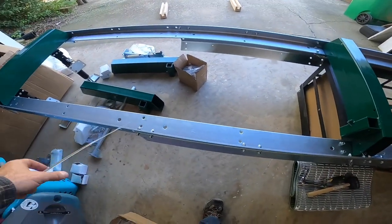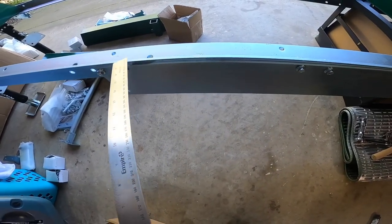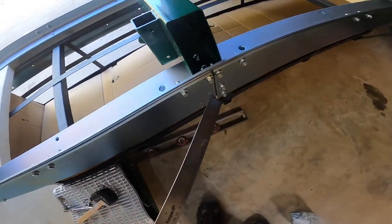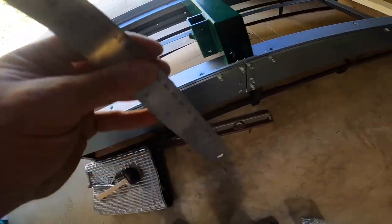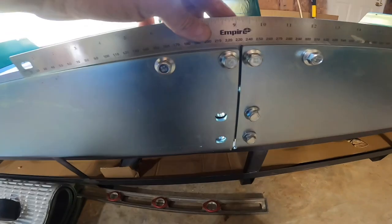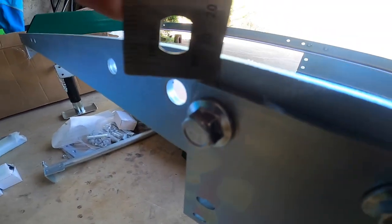All these side bolts are totally loose right now. What I'm going to do is make sure this reveal from the long rail - this is the track that the sawmill sits on - is even all the way down on this plate. The specs call to tighten these two bolts and the end bolt, torque those down, and then work on the second plate because this has to have no gap and the reveal has to be the same. I just tightened this one bolt down.